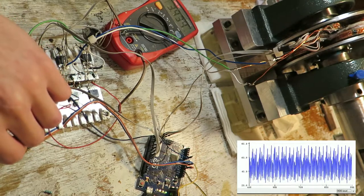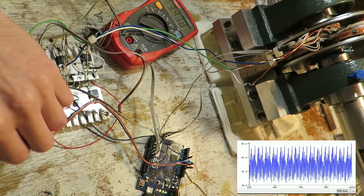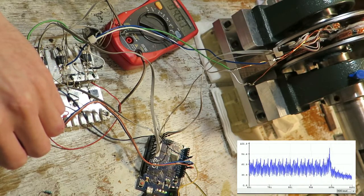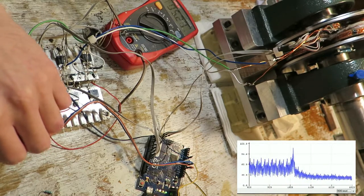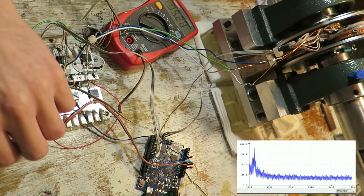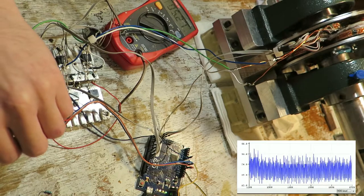Okay, moving on. In this clip, I am plotting the time which the motor spends on each position that can be sensed by the Hall sensor. At constant speed, this should be a straight line. Obviously, there is some mechanical resistance of the bearings and whatnot, but it's pretty noisy. The time is actually in milliseconds now, if you can read the numbers.